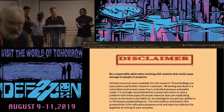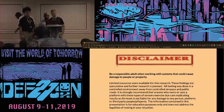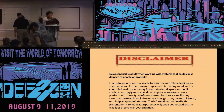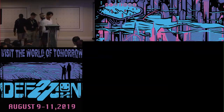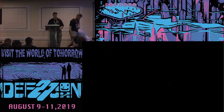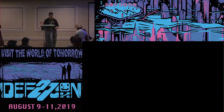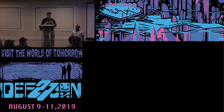Thank you. We're really glad we could share this information here at DEF CON — this is some of our first time here, so we're really excited. Thank you, gentlemen — good job. These young gentlemen did a lot of very hard work trying a number of different substances. For those who asked how a CD can reflect visible light but absorb infrared: they use an infrared laser to burn holes in the CD and read it — it's designed to trap light, essentially a photon trap. So the disc looks totally silver to you and me, but at that particular frequency of light it's effectively invisible to the LiDAR sensor.